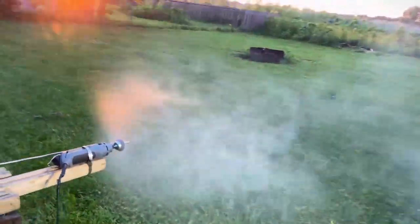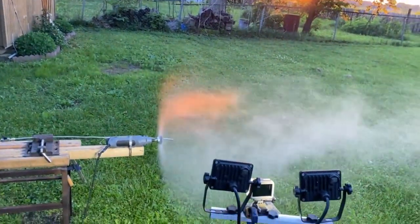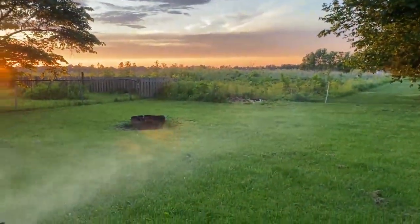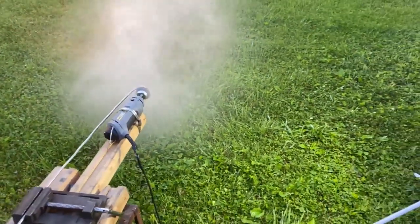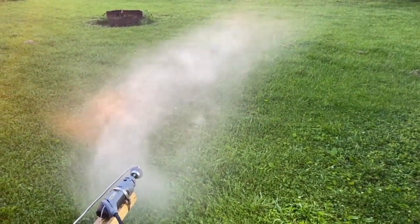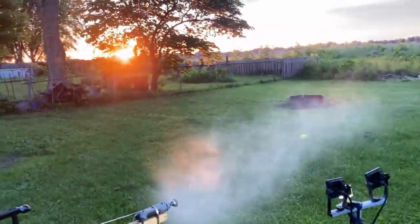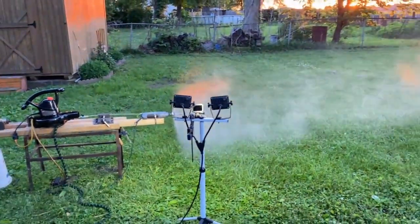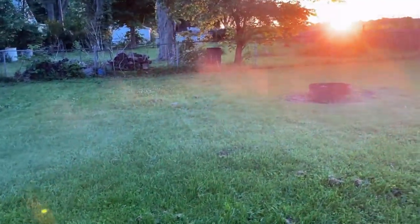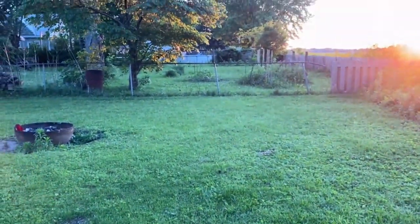It's got to handle clogs — I can't have a bunch of little screens and sintered filters. Essentially what this is, is a garden hose spraying into a spinning wire wheel. You could put a different rotary cup on there, but I thought this would give us features with minimal work. The burner is going to run on oil; this is water, but I thought I'd just do a preliminary test to see if it would be worth putting inside a combustion chamber. High pressure oil pumps can get expensive, and a rotary cup could probably do the job just as well.